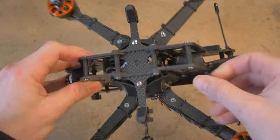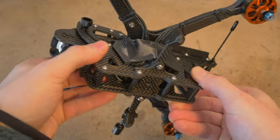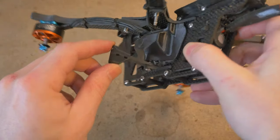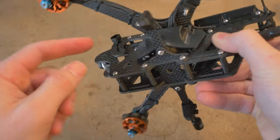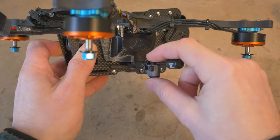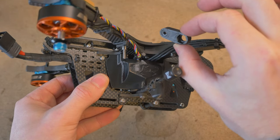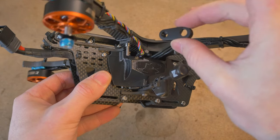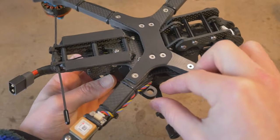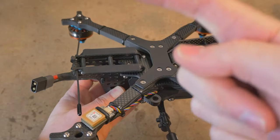To keep the drone balanced on its takeoff surface, I have these landing legs which are a separate part from the rest of the drone. Because they're sticking out so far from the chassis, they're a bit more vulnerable in crashes, so they are easily replaceable and I do sell spares on my website. They also serve as a mounting point for your VTX antennas. You can also use SMA antennas for a long range build using these 3D prints that come with the kit, mounting onto the rear screws so your antenna sticks out the top.